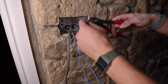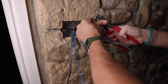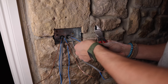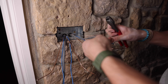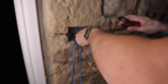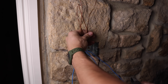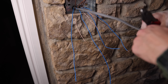So while I'm stripping out I'm going to try and make sense of it. So this is feed — I'm just going to chop, not going to leave any strips on it. I want this in switch number two, so I'm just going to do two little pulls on the wire so I know that's going into switch two. Neutrals are all going in together, earths are all going in together — easy peasy. This one I think I want in switch one, so we'll just do one little stripe. Switching is ridiculously easy — it's made out to be complicated because you've got so many wires, but it's just not complicated.